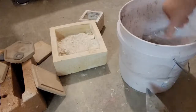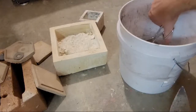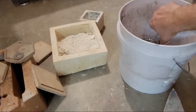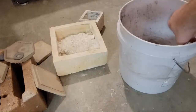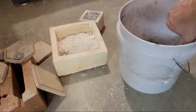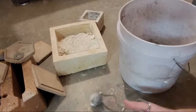This was a hollow part, which is pretty unique to how this method works. It's directly 3D printed so I can print it in whatever shape I'd like. To save material I used a hollow bottom and filled that area with ballast, which reduces weight — not that this is an engineering part — but it also shows some capabilities that you can't easily do with other methods.